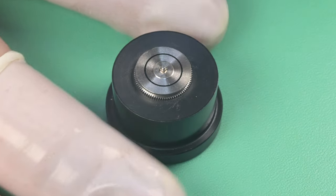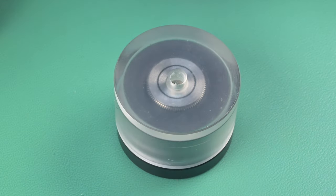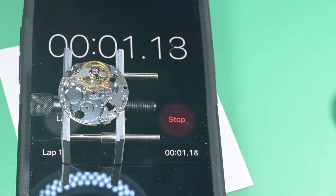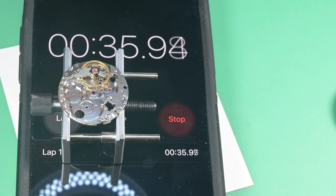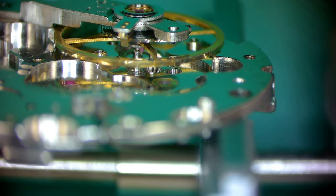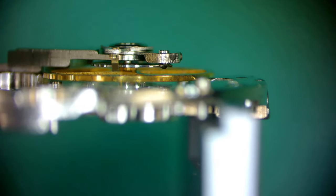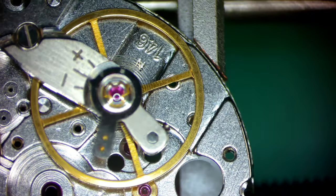We put the barrel in, re-lubricated, and close it on the barrel closer to apply even pressure. I bypassed videoing all the jewel cleaning — this is the test afterwards where I lubricate the balance assembly and put it back on the cleaned main plate. I use my phone as a quick test and like to let it run at least 30 to 40 seconds. I do a close inspection making sure the impulse jewel is dead center at rest between the banking pins, in line with the pallet fork and escape wheel, checking hairspring flatness and engagement with the regulating pins — everything looks really good.